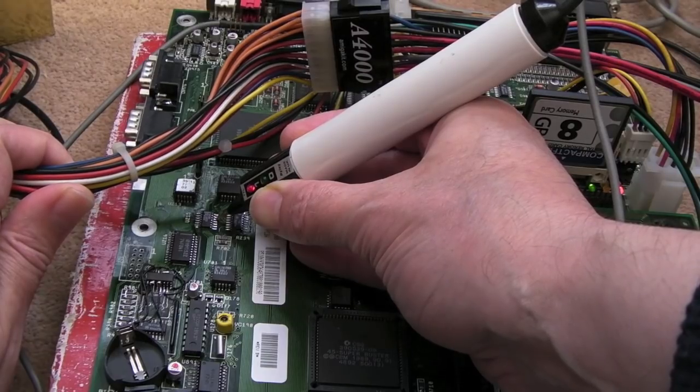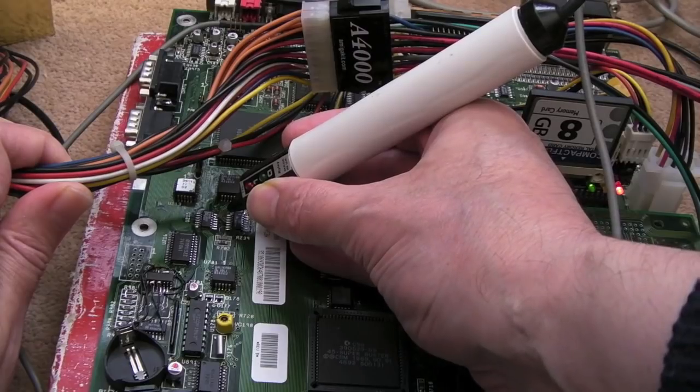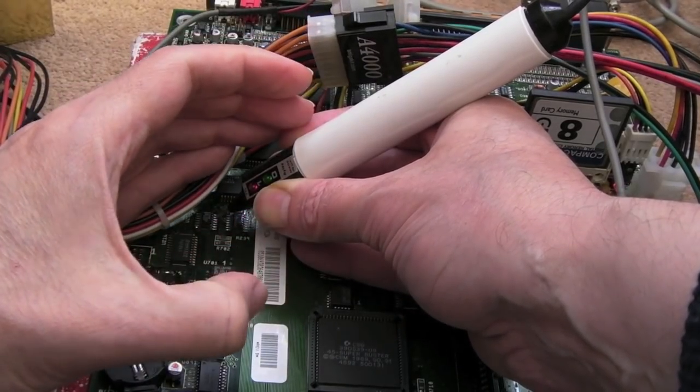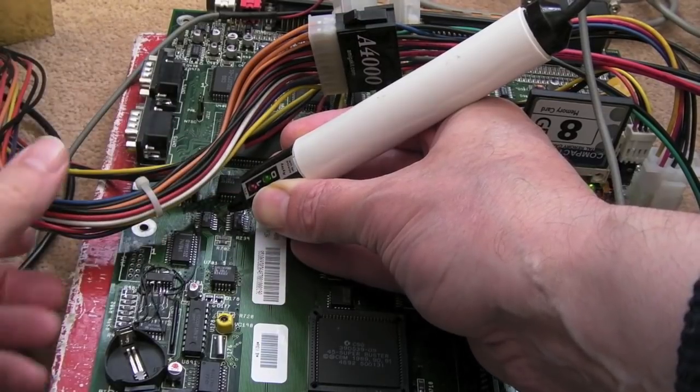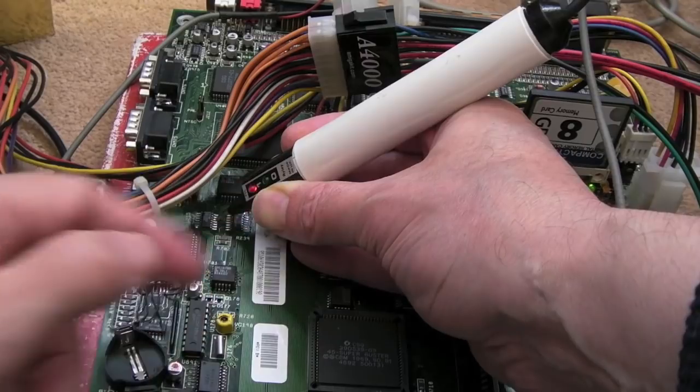The read-write pin should be going between high and low. And if I look at its input, hang on, the input's pulsing. I don't know if you can see that. Might zoom you in. But it's red and it's green. Yet the output is stuck high. It's not going low.